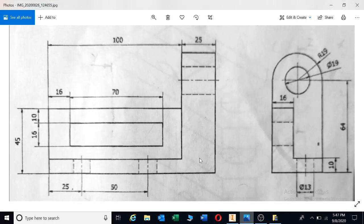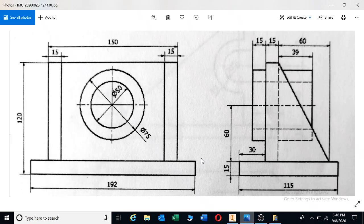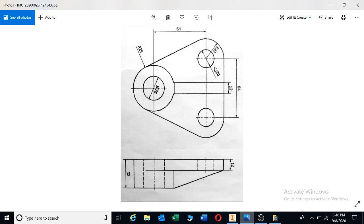Let's look at the next drawing. I can see here I've drawn this shape. If I had drawn the other one, not even a double extrude would have worked because of the V-shapes coming out on the side — I would have had to trim and sketch on the top as well. By drawing this shape I have this whole wing, and that wing needs to go up to the same height. Going straight across, the wing thickness is 12 millimeters, that round shape is 25mm, it's 50mm diameter and 26mm diameter on the inside. Going straight across the thickness there is 32, and we have a rib of 12mm wide.